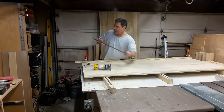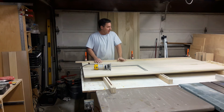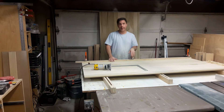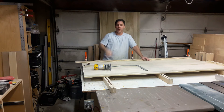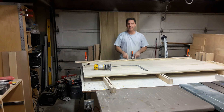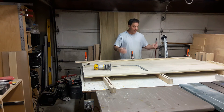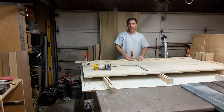Now because I am clamped on both ends in the middle, when I pull the router tight to the fence so it doesn't wander, I'm not going to bow the middle of this straight edge. The same thing happens with a metal straight edge — at Home Depot you'll see two four-foot pieces of steel or aluminum next to the levels, and that straight edge will bow the same way. Even a track saw track without the router assist will bow as you pull toward the fence. This is a good technique to learn. I'll show you one quick line of the V groove and then move this out.